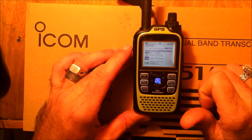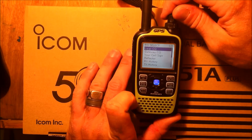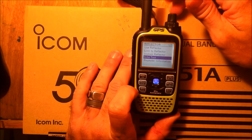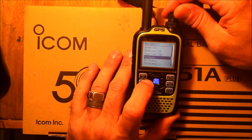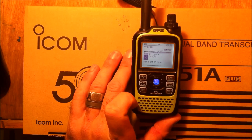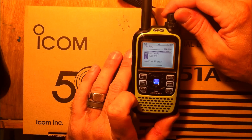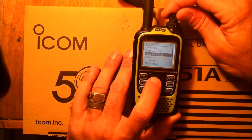You'll see I'm set to CQ. If you want to go through the Fort Pierce machine and talk on a gateway, you go up to CQ and set this — you can do local CQ, gateway, or reflector. You can also change it to echo test — you transmit and it receives your message and plays it back to confirm you're getting into the machine. Call sign routing is really cool on digital D-Star: if I want to call K4CPJ through the Fort Pierce machine, it'll come on his radio that KJ4YZI is calling him. If you have a friend in New Jersey or Alabama with a D-Star node, you can route it to their call sign.